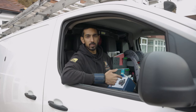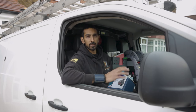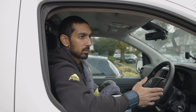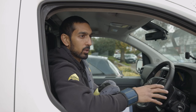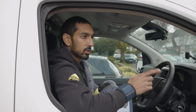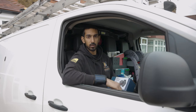The reason I'm doing this is because I came last week to do a power flush on the system and I noticed that the existing pump was running quite weak — it wasn't getting enough heat around the system. Even after flushing and getting all the dirt out, the pump still wasn't working to its full capacity. I used the Grundfos GO app to determine the correct replacement, which is a really easy-to-use app — I'm going to share how to use it later on.